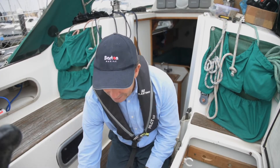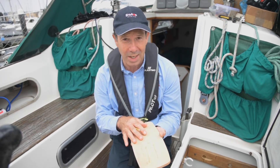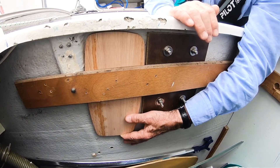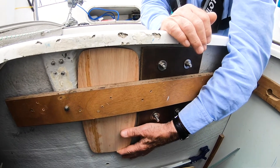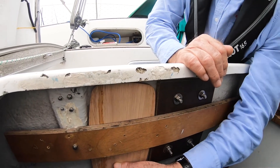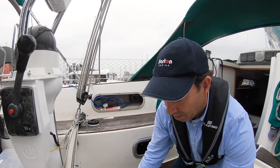You're also going to need a backing plate for inside the locker — that could be plywood or hardwood — which really needs to be bonded to the side to spread the load. This goes into the cockpit locker and needs to be bonded into place. Ideally it should be a minimum of 250 millimetres by 250 millimetres. As you can see on this boat, we are slightly restricted in space, but it should be okay as it's an enclosed cockpit locker. So a bit of bonding to do, and then you can mount the end plate.